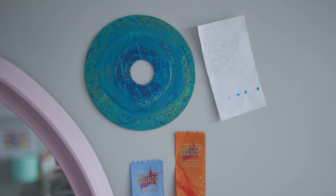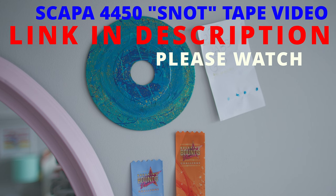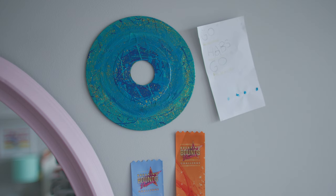In the film and television industry, we never use blue tack, but we often tack stuff up onto the wall or onto a table. We use something called snot tape. I'll put a link to it here if you want to see how that works. I would recommend to anybody thinking about going the blue tack route to consider snot tape, which is sort of a clear butyl. It's way stronger, way more reliable, not permanent, but way more reliable than blue tack. And since it's clear, it doesn't have the same kind of problems with staining the wall. I'll leave a little bit of that with KK and her mom in case these items fall down — they can replace the blue tack with snot tape and hopefully have a little more luck.